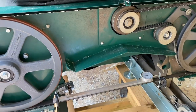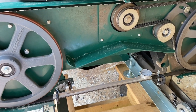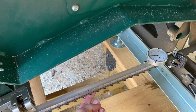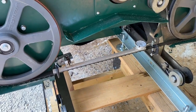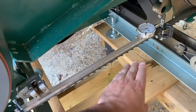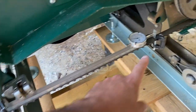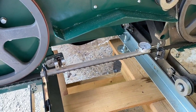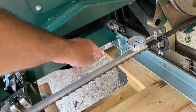The blade wants to spring back to more of an oval shape, so if I push on it, you'll see that dial indicator moves. I had a hard time determining what my zero was going to be before we really start stretching the blade, because it doesn't want to lay flat until you put just a tiny bit of tension on it. Before you tension it, when it's slack, it wants to dip down, and up top it wants to go the other way — it's trying to get back to its big oval shape.